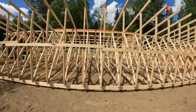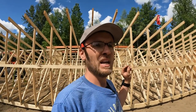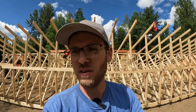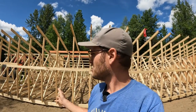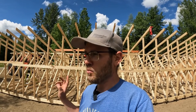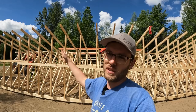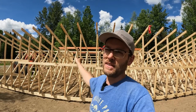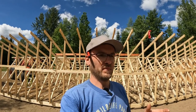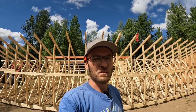And as far as cost, well, some people wonder about cost. To set all these trusses with a machine or a truck, a small crane truck, is gonna run more money than what it's gonna cost to just set these in two halves. So this is 48 feet. We're gonna break it in the center at 24 feet. So you have two manageable lifts. Allows the truck to get right up beside it. And it's easier to maneuver them.